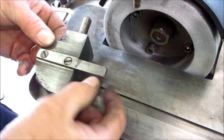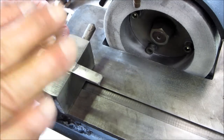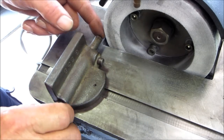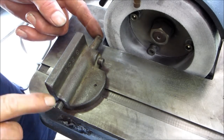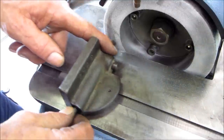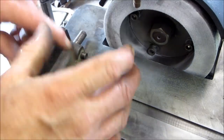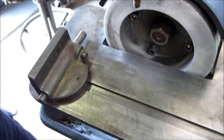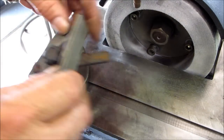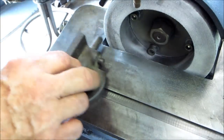All right, we went ahead and milled this down to the thickness and width, and got these two countersinks all set up so that it mounts and rides in the slot. We put a rod inside here because there is an adjustment here, so we can fine tune and slide this and not have any in and out, because we can't hold it physically against the other guide, against the other unit like this. All right. Let's give it a try.